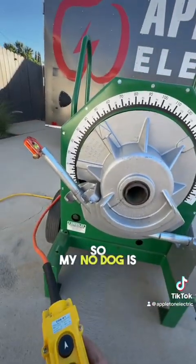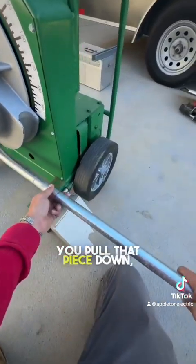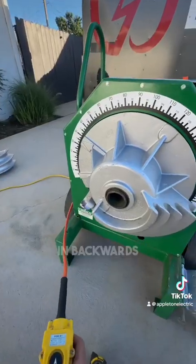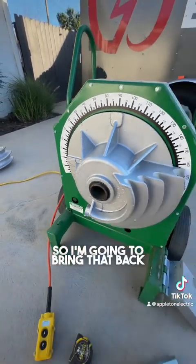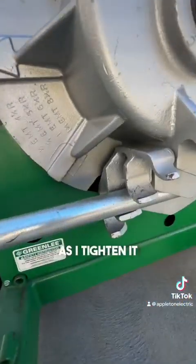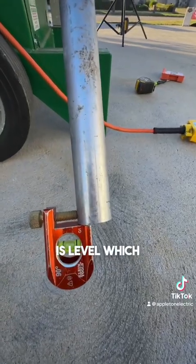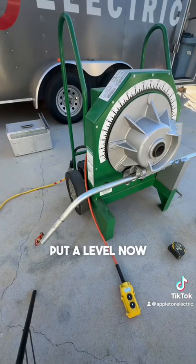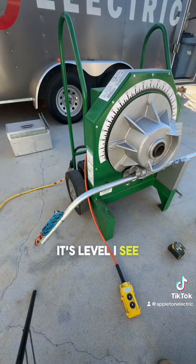My no-dog is dead nuts. I'm going to back this up — you pull that piece down, the stand down, and it will allow the pipe to slide out. Now I'm going to slide the pipe in backwards but I have to get the shoe back to zero first. I'm going to bring that back to zero and slide the pipe in from the opposite direction. As I tighten it down, I want to make sure my no-dog is level — which it is. A little trick I do with offsets is I'm going to put a level on top right here, so that when I bend it up and it's level, I can see it.